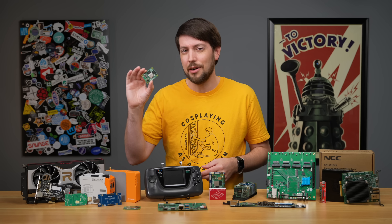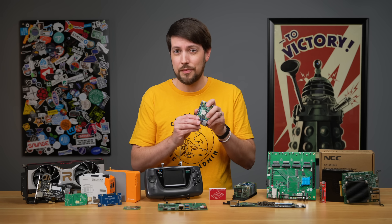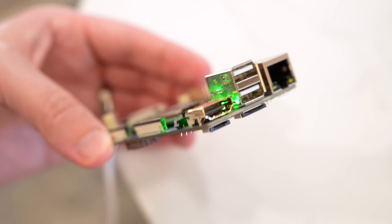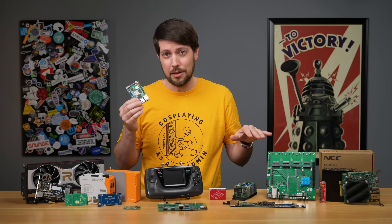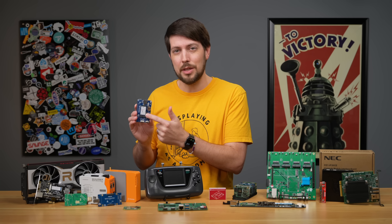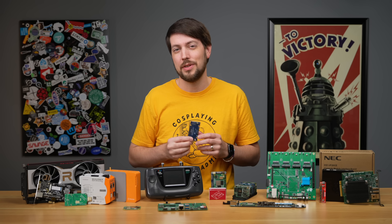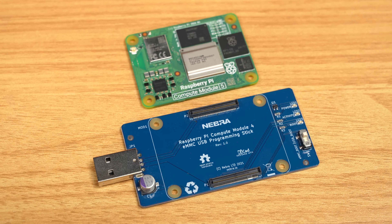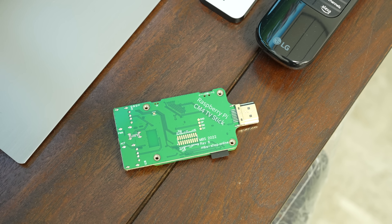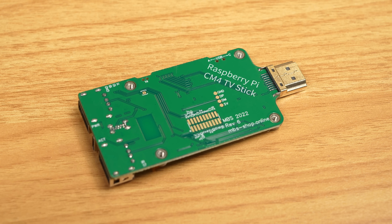The compute module thrives being used in carrier boards — I've covered tons of these on my channel, and there are at least hundreds to choose from. Waveshare built a little carrier that basically solves my two biggest gripes with the Raspberry Pi 5: slap a Compute Module 5 on here and you have a Pi 5 with full-size HDMI and an NVMe slot on the bottom. An SSD that got 420 megabytes per second on the CM4 gets an instant speed boost to 800 megabytes per second on the CM5 when you bump PCIe to Gen 3. There's also this handy tool for flashing or debugging compute modules with eMMC — just stick the module on it and plug into USB, and it works perfectly with the CM5. One board that had trouble is the CM4 TV stick — the USB-C power input didn't like the Compute Module 5, so not every carrier works right out of the box.